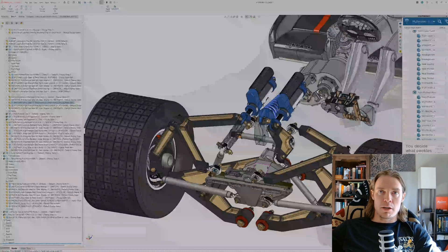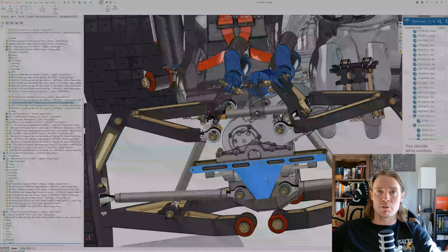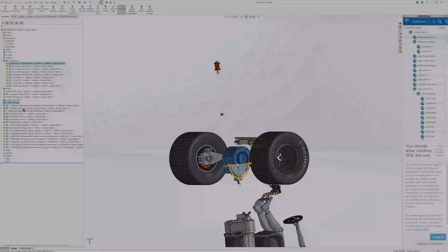This is a really cool, compact way to do push rod suspension — combining components where the pivot axis is the torsion bar and the torsion bar imparts the load on the heave spring. There's also a regular steering rack here. I found a great model on GrabCAD and just had to make an adapter plate to lower the pivot points for the steering tie rods.